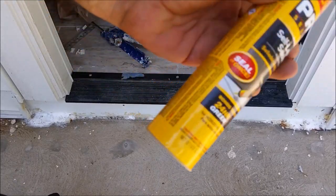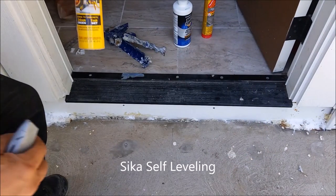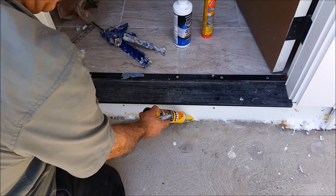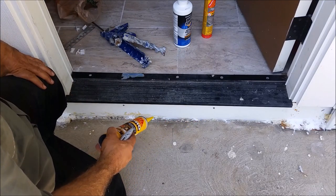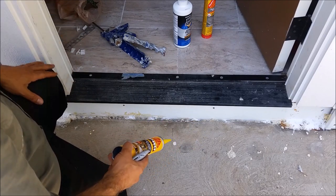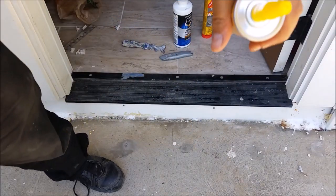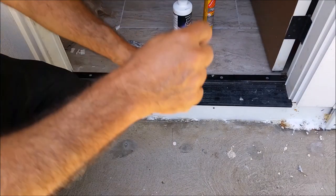So to seal the area I'm using this — it's called Sika Self-Leveling. Remember what happens here: it will go inside and sink on the foam, but it really sticks to the concrete from each side — from this side and to this board on the other side. Because it's self-leveling, it expands and will stay there forever. I'm going to put tile over it, and the work is done forever. Just cut it — it's cut perfectly, no need for a knife. You have to punch a hole inside and then it will go.